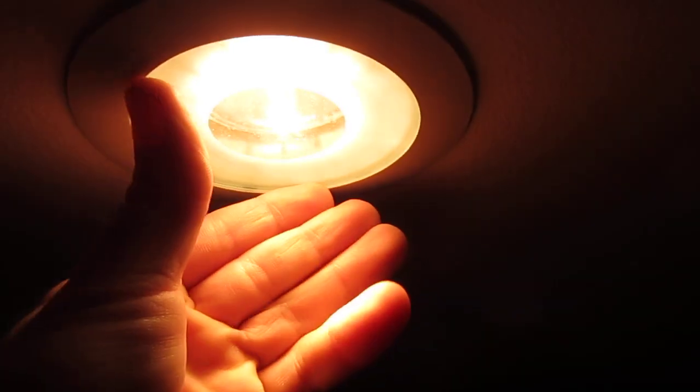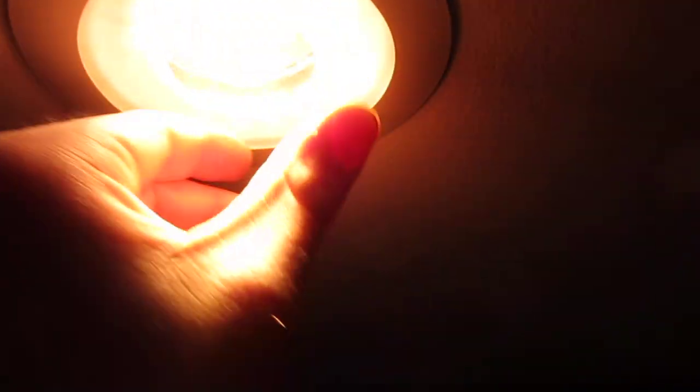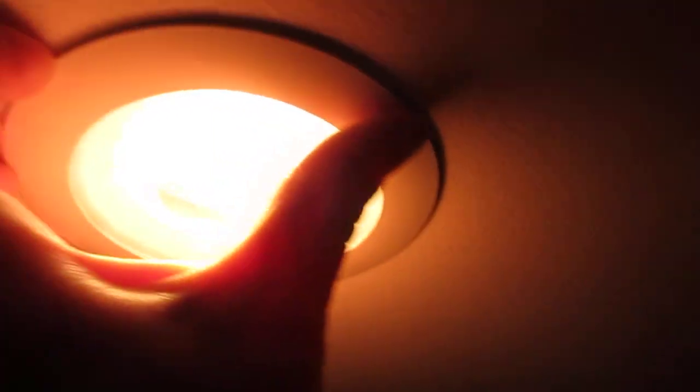So this is the light fixture here. My first thought was basically to just twist this little cover here to see if it would come off. But you can twist this all day and it won't really make a difference. What I found by trial and error is you actually need to grab the outer edge of the fixture here and pull it all down at once.